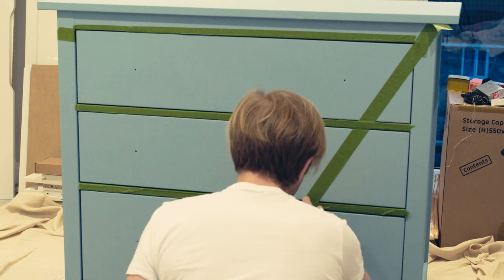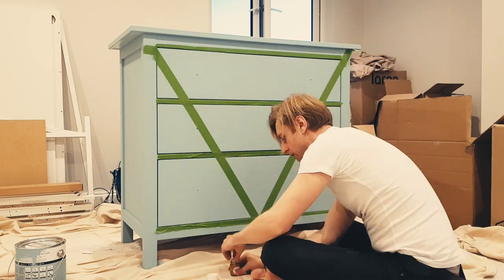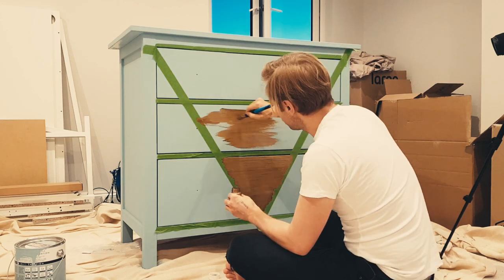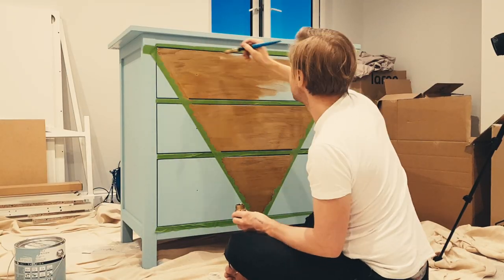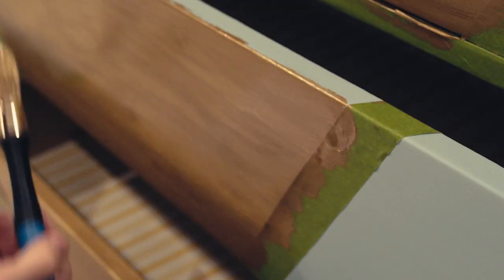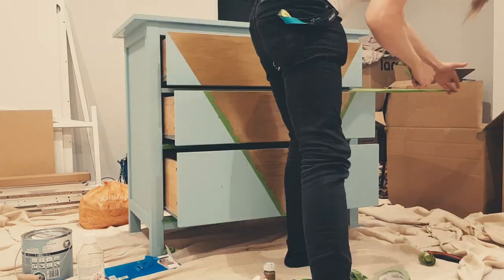With the centre marked, I used the frog tape held taut to get my straight edges masked out. I then shook up my gold leaf pot and with a small brush began to paint left to right to fill the masked areas. You may be wondering why I opted for this over spray paint — well, I don't need to worry about ventilation or breathing in nasty fumes, which would have meant taking these drawers outside to spray. But mainly, I wanted to get this really different grain-like effect that the gold leaf offers, as a contrast to the matte look of the blue body. Once I'd completed the main parts, I pulled each drawer out carefully having cut above the dividing line to remove part of the frog tape, folded it back over the top, and completed the gold brushwork on the top edge of the drawer, so that you see the gold look continue when you open each drawer. It's these little touches that really sell a piece of upcycled furniture to feel like a distinct product, as opposed to a simple repaint.